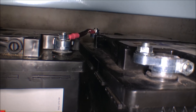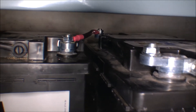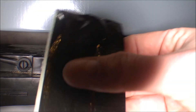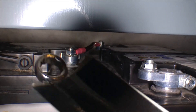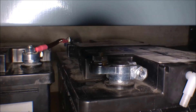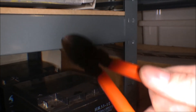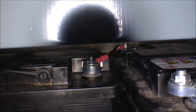I have put on the first connector. I had the batteries out here, placed them, and tightened it, and for safety I used a wrench and put duct tape — gaffa tape — around it, so that I'm not able to short circuit anything, which is rather important when working with big powerful batteries like this. Also, I have kind of an emergency cutter just there, so if anything weird should happen I should be able to cut a cable.